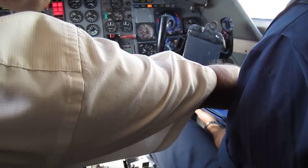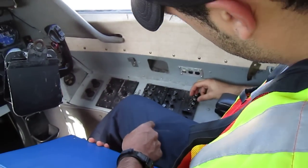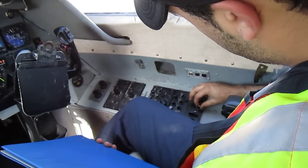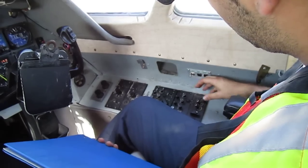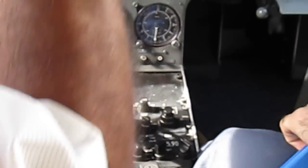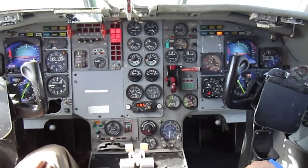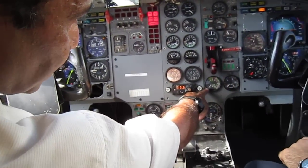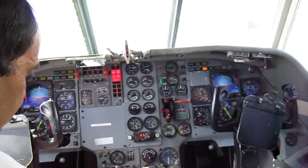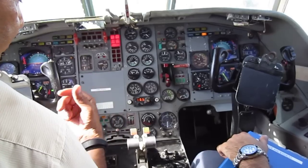On the right-hand side there's an air conditioning switch and bleed switches. Open both bleed switches and we'll get cabin pressurisation coming in. You can see the cabin vertical speed indicator descending — because as pressure comes in, the cabin altitude descends. Cabin pressure is just coming up to about two to three PSI. One fuel flow gauge is fluctuating because the fuel flow transmitter has been damaged.